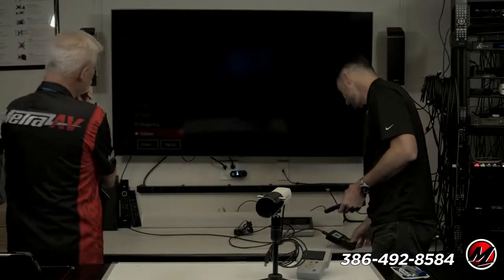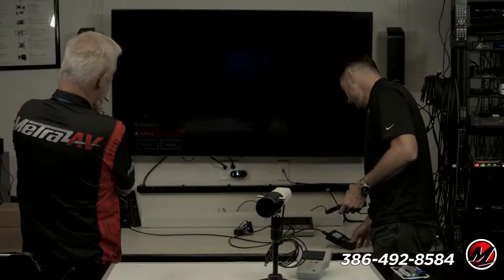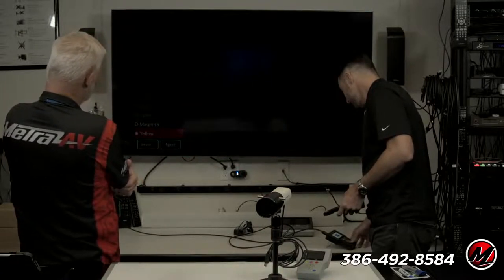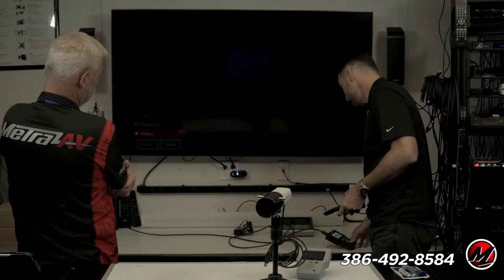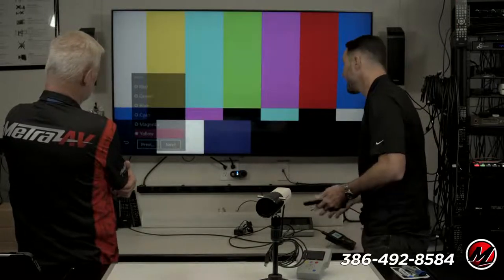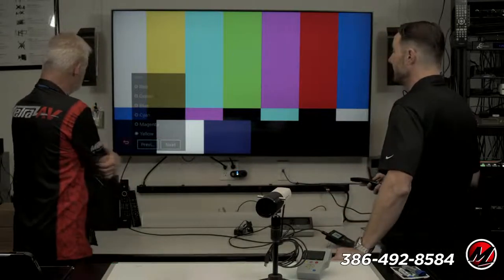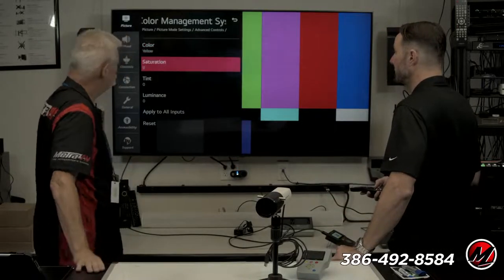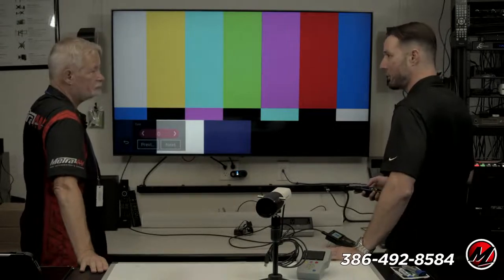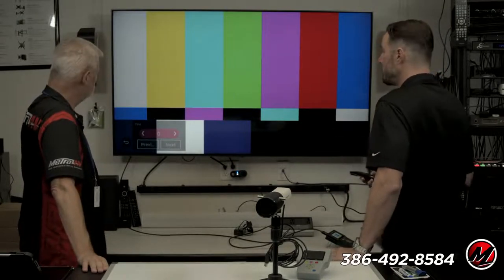we'll go back to those color bars, and I want you to tell me. You know where those color bars are, don't you? Oh, yeah. It takes some practice, and it takes a lot of looking at them to be able to look at those alone and tell what might be going on. But in any event, we'll go to the yellow control, and I'm going to take the tint control for yellow. Now, remember when we changed the tint control before, it changed everything? Mm-hmm. Watch what happens when I do it this time.